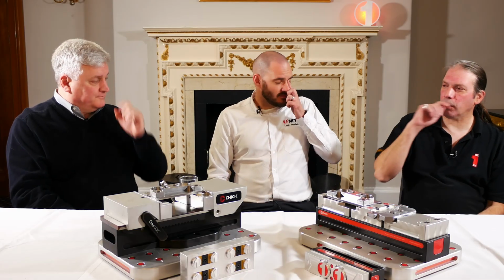Sorry, that's very important, isn't it? Because you're machining jaws to suit the job. Mm-hmm. When the jaws go on, the base needs to be in the same place every time, doesn't it? Because then you're preserving the datum and your whole setup stays set up, doesn't it? Okay. Exactly. Sorry, I interrupted you there. Don't remember what I was going to say.